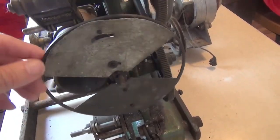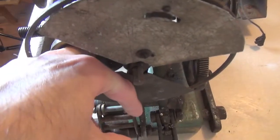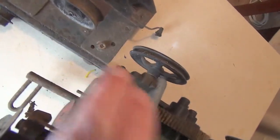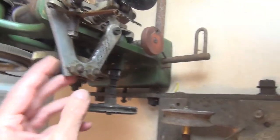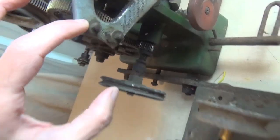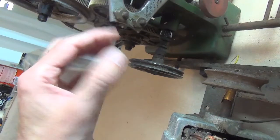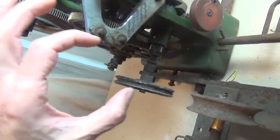What could well be the original shutter — which is certainly not always the case with these old machines. There is no lens; someone's had the lens away, but that's okay, I've got something suitable. Also, this piece here is of great interest for other reasons, but immediately we can see there are two nut and bolt arrangements here, and these nuts were extremely loose, suggesting that the ring that would have held the lantern slide lens has recently been removed. So whoever took the projection lens probably took the lantern slide lens as well.